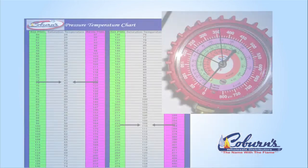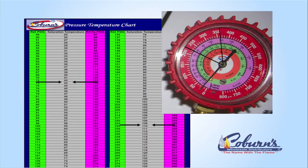The next thing we're going to do is measure the subcooling. Subcooling happens on the outdoor unit, on the condenser. Now we're going to look at the red head pressure gauge. Under the pink or under the green scale, you're going to see that we have a 110 degree condenser saturation temperature, or 110 degree coil temperature.